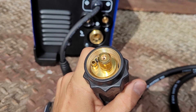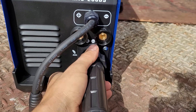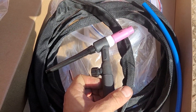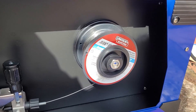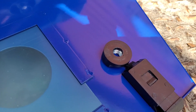It's got the European-style connector on it. The TIG torch looks pretty good. We can't test it in this video because I don't have any gas, but it looks like it's just as high quality as the rest of the machine. It's got this collet design and takes a 5/64 tungsten. I got this flux core spool on here we're going to test first. It's got this spring and this nut to keep it tight.